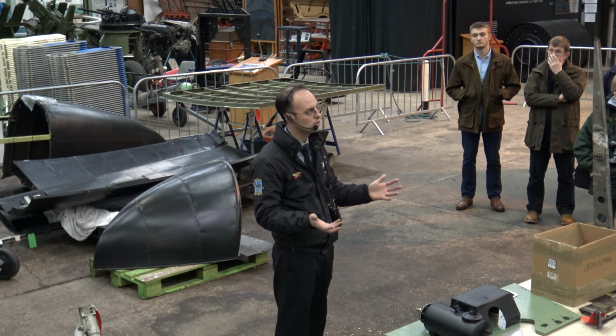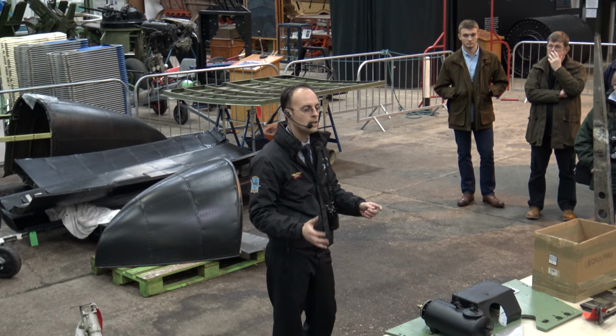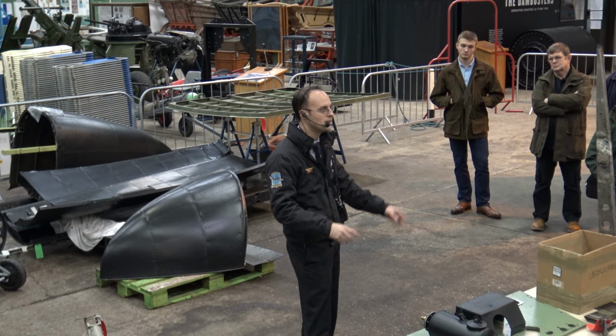There is corrosion inside the tubes as we expected, but it's nothing that's actually going to stop us from taxiing the aircraft. One plan this summer is to have brand new engine bearers produced. We went over to Canada in 2009 and brought back, I think it was about 9 Canadian Mark 10 engine bearers. So that gives us all the machined attachments where it fits to the subframe, sorry. So we can take all those out of the Canadian bearers and send them off to have the new tubular structure built up, welded up, preservative inside, painted, so they'll be sat ready for the day when we put the new power plants on, ready for airworthiness.